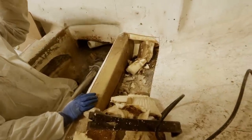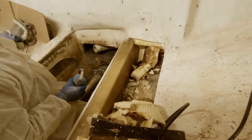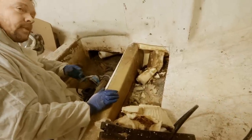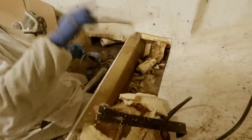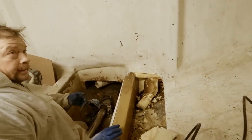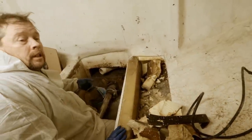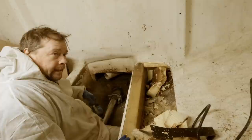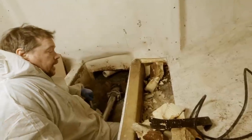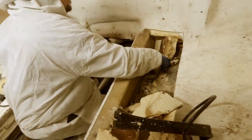After a certain age, this foam starts to absorb water, and depending on the job, the install, and everything else, it happens. Just in the case of this vessel, the deck joint to the hull was compromised, and so water was finding its way in from there. We've sealed that up now, so this shouldn't be an ongoing problem. When we come in here to refoam, all of that's going to be redone too and beefed up. So we shouldn't have this problem again, at least not in our lifetime.